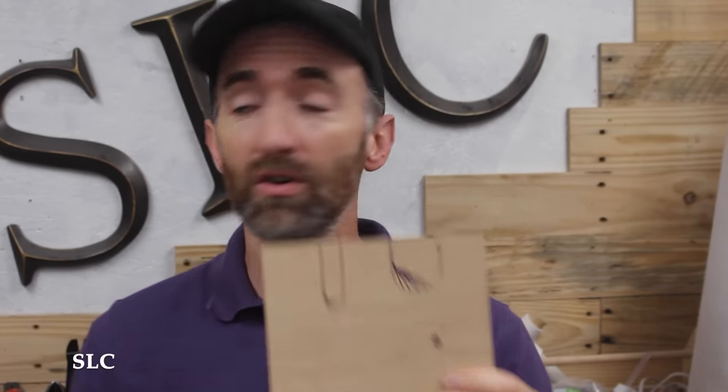Whenever you're cutting a line from the outside, if you start the blade before you touch your wood, there's a good chance it's going to vibrate and be a little bit hard to start that line correctly. I've found that it's better if you actually take the blade and gently put it right up against the wood — just gently — then start the blade real slow, and as you start to go in, speed up the blade. Right on the line.